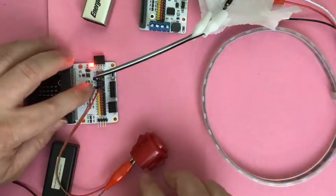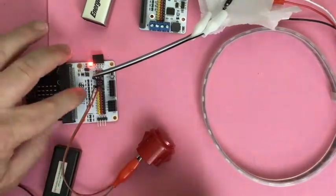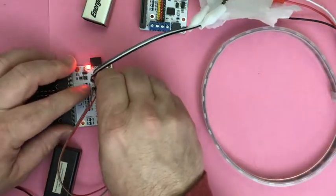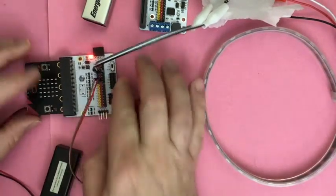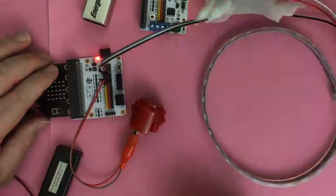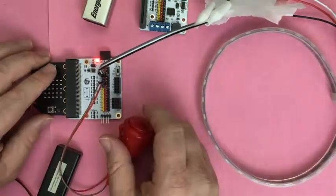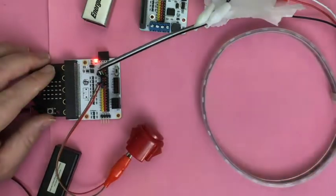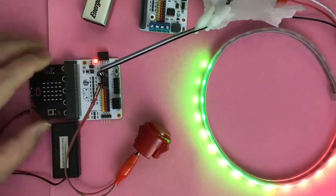If you play with it on three volts on this board, because I set it up the same way with the same pins — pin 9 and pin 13 — on this board, pin 9 is a high voltage, five volt pin. So it makes things work funny. For example, if I put it at three volts, I can do the red and clear, but the button is not making things happen at the right time. It doesn't clear with button B like it should. Maybe the battery is wearing out and not providing the right amount of power.